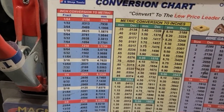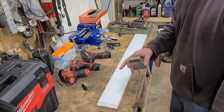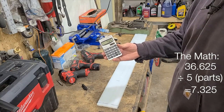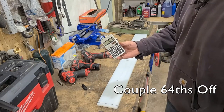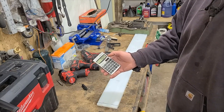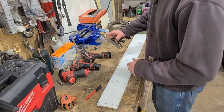It's handy to have a conversion chart, which you can just Google — it'll show you how to convert fractions into decimals and back. With my measurement between my two marks being 36 and 5 eighths, that comes out to 7.325, which is almost 7 and 5 sixteenths. I'm going to mark from each side and the variance will be in the middle, and I'm completely okay with that because it doesn't need to be perfect.